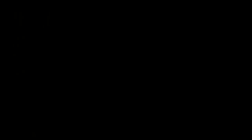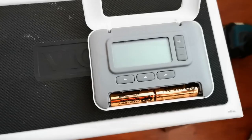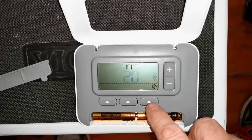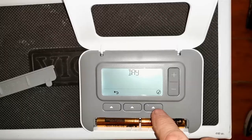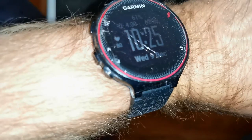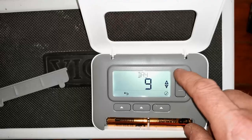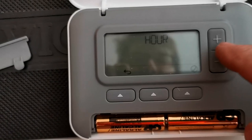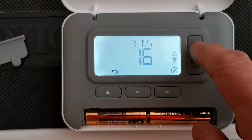Now I need to power up the programmable room thermostat by putting in the batteries. Once I've done that it should send a signal to the receiver box, linking the two together. I'm not going to go through the whole programming of this unit because I've made a very detailed video about that — you can find it in the description below. You can see it's fairly straightforward: you just follow the menu through and press the plus, minus and tick buttons as you go. I'm setting the date — it's the ninth, so I press plus to nine and then press tick — then I set the hours to 10 and the minutes to 28, press tick, and it saves those settings.